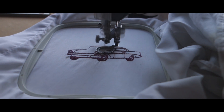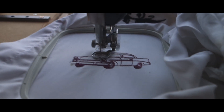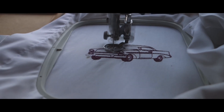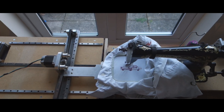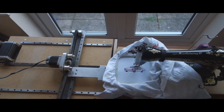Another downside is the embroidery file — you save it as a Tajima format, and then some software from Khalid off of CNC Zone is used to convert it into G-code for Mach 3 to run. So there's a bit of faffing around with file formats, but it works quite well.